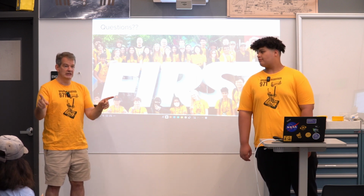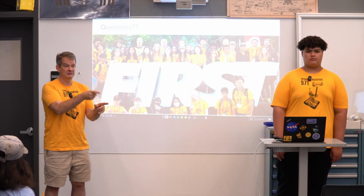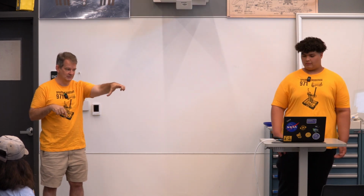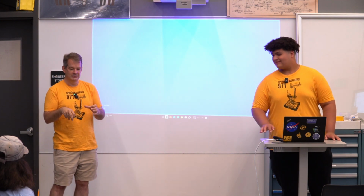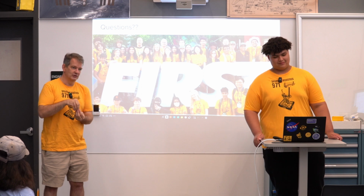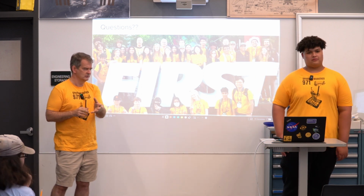No, we're taking each estimate independently, because each estimate is giving us an estimate of the robot position, because of the extrinsic calibration. It takes a measurement of the tag and transforms it from the camera back to a single robot frame. Every time we see a tag, it can even be 2 tags in the same view, every time we get an estimate, we're fusing that data into the localization estimate. Did that get your question? Yeah, okay.